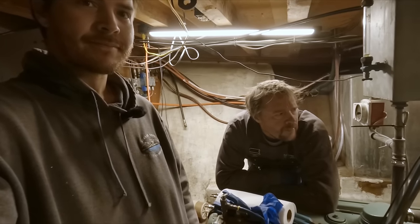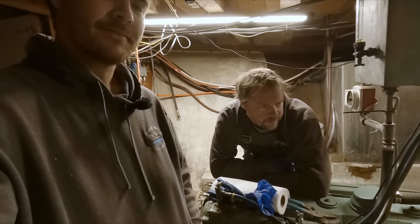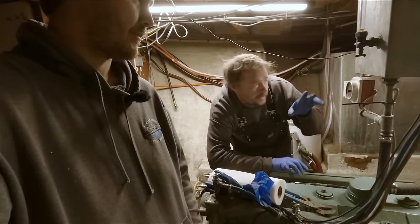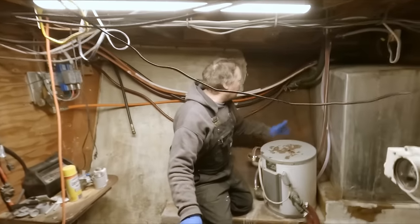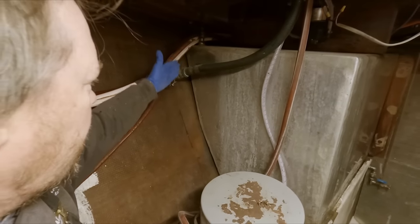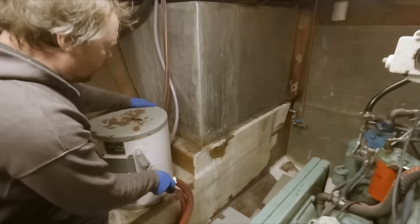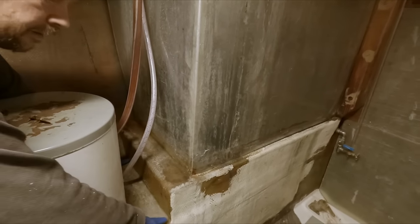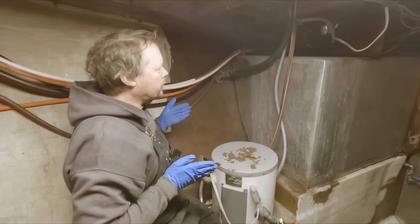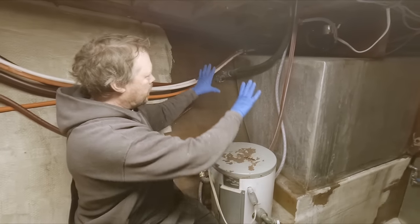Generally speaking, bladders come in different form factors. Generally they're square or rectangular, and none of these really fit that. These tanks, as you can see on this one, are actually saddled into the hull, so they're tapered on the hull side to fit that contour. They're much skinnier at the bottom. These tanks come down into here somewhere, so they're very narrow at the bottom, wider at the top. That taper also goes back this way, so on the bulkhead side, they're wider at the top and on the bottom than the forward side here.